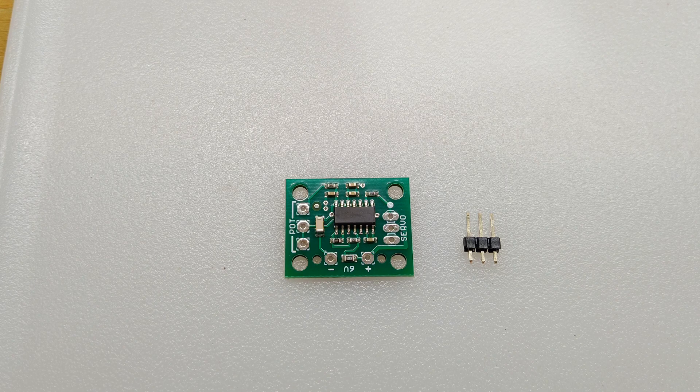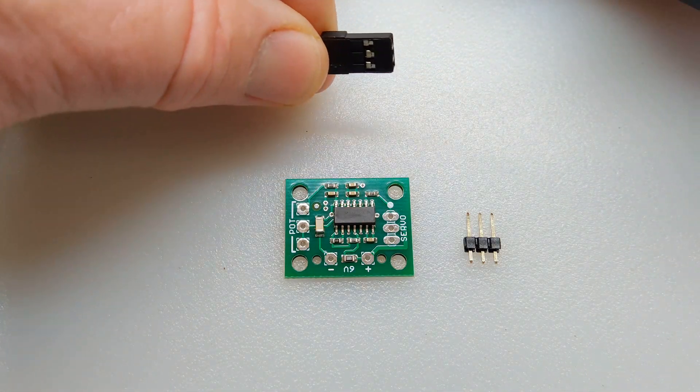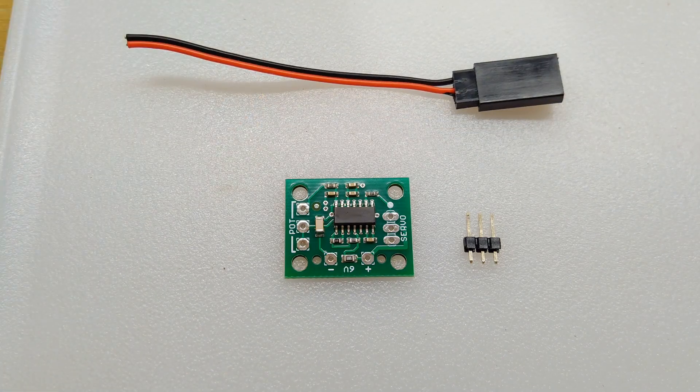To use this with the servo motor, I'm going to need to run the power into this board separately. When you use it for an ESC, you just plug the ESC into this board and you don't have to worry about power. But as you see right here, you've got a plus and minus connection at six volts. In order for this to work with the power supply I'm using, I had to take one of these three-pin connector extensions, cut off the female side, and strip off the white signal wire, because this is going to act as my voltage plug to run this at six volts. That's the little difference I made there, and you'll go ahead and solder them in where I showed you.